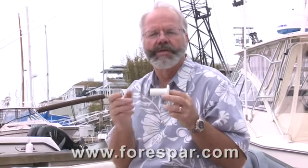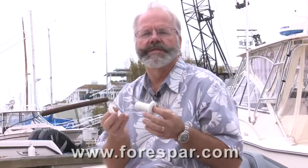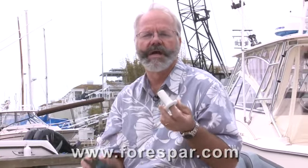It's also important to note that marine thru-hulls all have parallel threads — no matter if they're US thread, BSP, or buttress, they are all parallel threaded. This is because no one ever knows the hull thickness they're going to be installed on, so a taper would cause problems as the thru-hull threads need to be cut to length for a given seacock or valve installation.